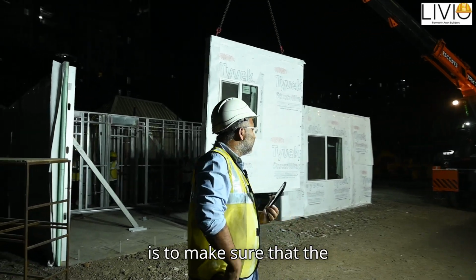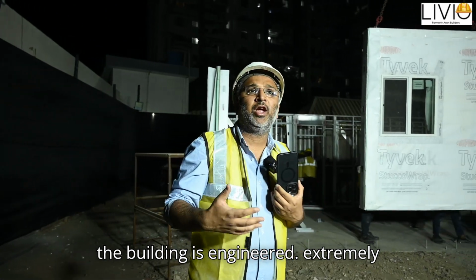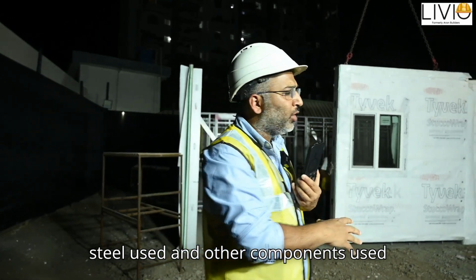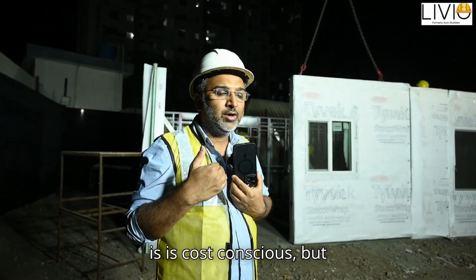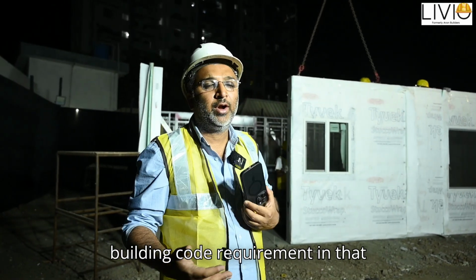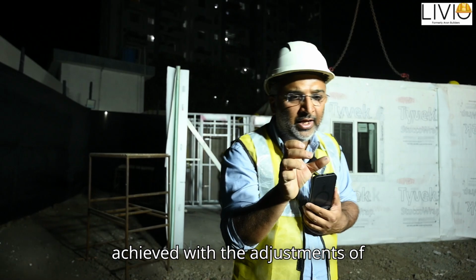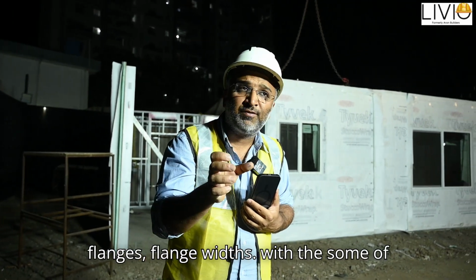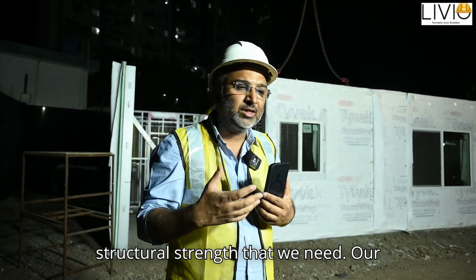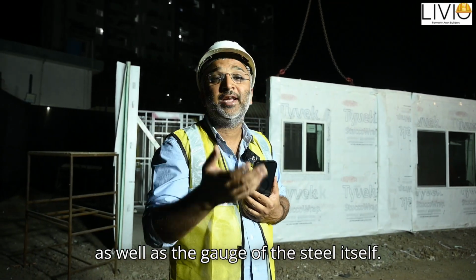Ultimately, our goal is to make sure that the building is engineered extremely cost effectively. The overall materials used and the amount of steel used and the other components used is cost conscious, but has to meet every single aspect of the building code requirement in that jurisdiction. So the buildings are engineered based on that, which can be achieved with the adjustments of flange widths, with some of the other levers to adjust achieving the structural strength that we need. Besides flange width is the stud spacing as well as the gauge of the steel itself.